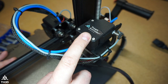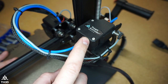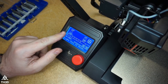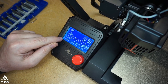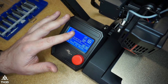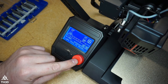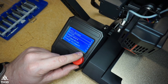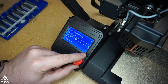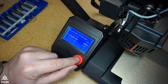This extruder uses 407 steps per millimeter on most printers with 1/16 stepping drivers. Now, if you're using our unified firmware, we have the option directly in the LCD to change the steps per millimeter. This particular extruder does not typically require reversing your motor direction. So to do that from the LCD, I'm going to hit the button here. I'm going to go to Configuration, Advanced Settings, and Steps per Millimeter. And we're going to change our E-steps here to 407.